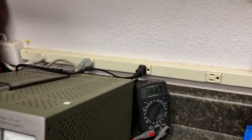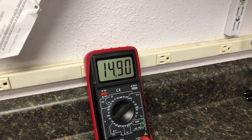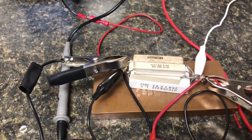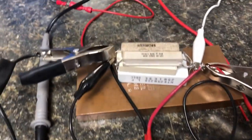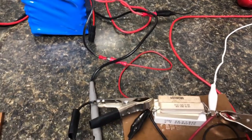that on. I've added just a cheap little inverter here, which has brought the current up from about 0.95 amps to a little bit over 1 amp, and the voltage has dropped ever so slightly from 15.1 volts. So here's the dummy load. This is about 16 ohms with however many watts. It's gotten kind of warm. I used a copper heat sink I've got for it. Didn't have any aluminum on hand, so I used copper, and it warmed up pretty good over that time.